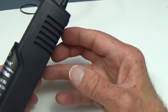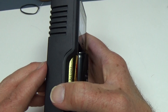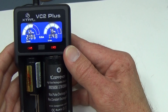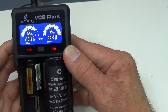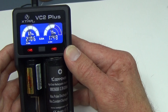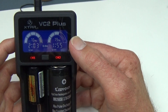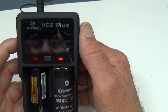You can use this charger for just about any type of lithium or NIMH battery you have. It guards against batteries getting too hot, and there aren't many mistakes you can make since it has intelligent circuits — it won't let you put a battery in backwards. If the battery is completely useless, it will refuse to charge it, though if it's at zero volts but still chargeable, it will charge it. Also notice the display dims after a few minutes, and pressing and holding the button will dim it off almost completely.